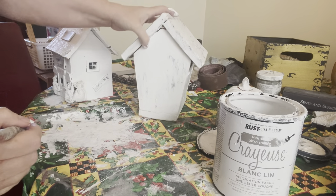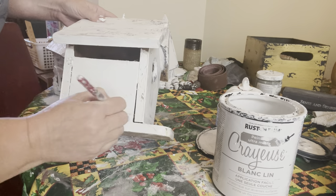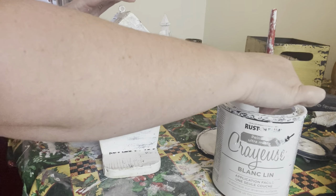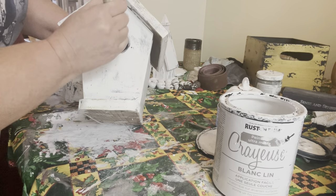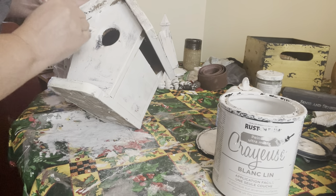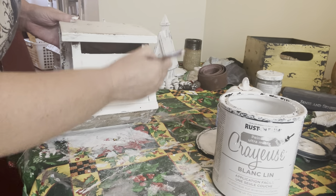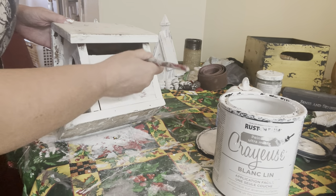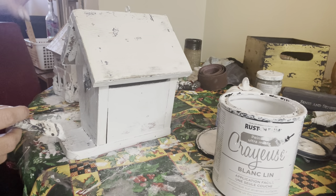I'm going over all the parts that have any kind of yellow in them — same concept for the trunk as well. A lot of the time the bleed-through is where any of the clear coat was heavy, or if there's any bleed-through from old wood. I find it's good enough without re-wet distressing back over those areas — you don't really want to wet distress where it's going to yellow. So just dry brush on to get the whiteness and still get the rustic look, then put white wax over everything.